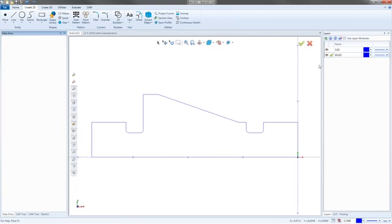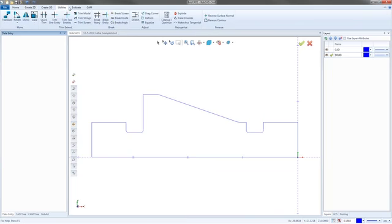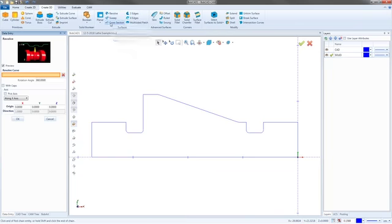So when we get in, we're going to create our solid. So again, you go to utilities, 3D, revolve. And you want to make sure to try and get the fillets. Anything you can add onto the part before you have the solid model is going to be way better than when you have the solid model. The filleting for 2D here is way better than filleting for 3-axis, or for 3D, just because it's a 2D shape. It's just easier to fillet, less going on. But it's easier then to revolve that kind of rotation to make it all work.